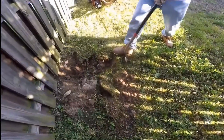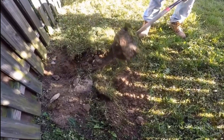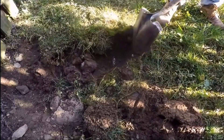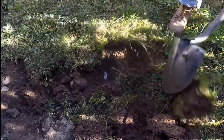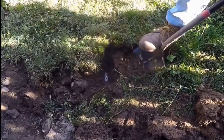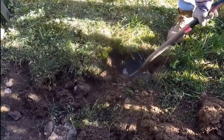Take a look. So before you trench, what we're looking for is sprinklers. Sometimes if you can find the line — you can see there's one right there — it's actually out at an angle, but if you can find that line, you can try to avoid them. But more than likely, those sprinklers are right where you want to be. So we're going to go ahead and trench through here and see what we come up with.